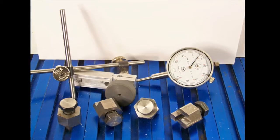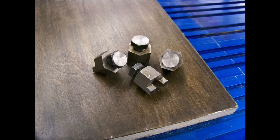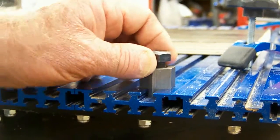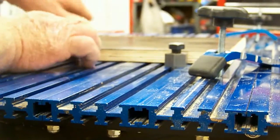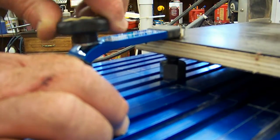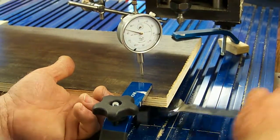It was this inefficiency that bred the invention of the Shark CNC Leveling System, a set of four adjustable jacks whose bases are keyed to the width of the T-slots used in most tabletop CNC machines. The heads of the bolts are contoured to a slight convex curve and contain SAE threads, allowing precise adjustment.